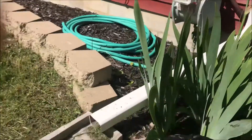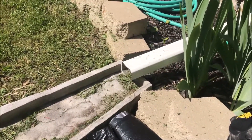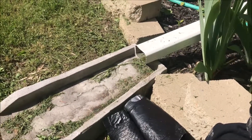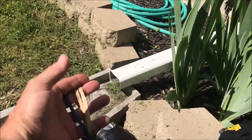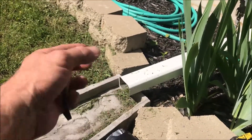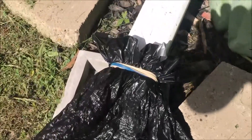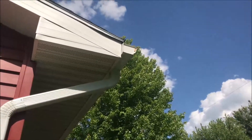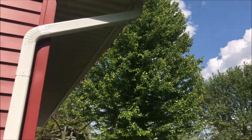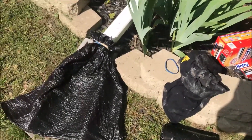To stop the flow up there, I'm going to take this rag. Once I see the bag is getting near full enough to carry, I'm going to stuff the rag in there to keep the flow from coming out, then switch out the bag. I'm using four very big rubber bands that I'm going to strap the bag on with. I've got my rubber-band-wrapped bag onto the end here, and now I'm going to make my way up that ladder and see if we can get this unclogged. I'm not going to forget my rag so I can stuff it in there when I break it loose.